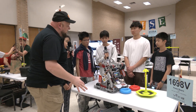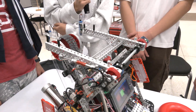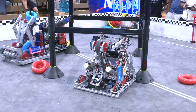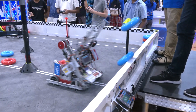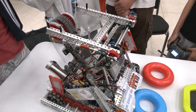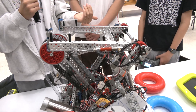Alex, let's talk about this Lady Brown mechanism you're utilizing on your robot. Obviously it's been a popular choice amongst many teams. How's this working out for Power Beans? So this has been working out really well for us. We've done a lot of wall stakes in the matches, and one reason behind that is because we designed our Lady Brown to be as versatile as possible. It's kind of short compared to a lot of other teams, because we need to be able to score on the alliance stake and also be able to tip and untip mogos.